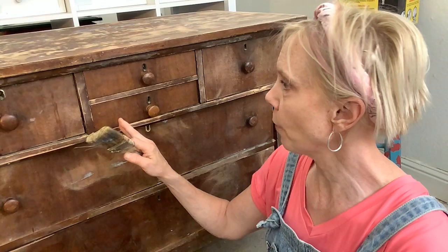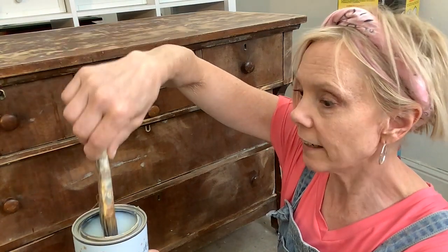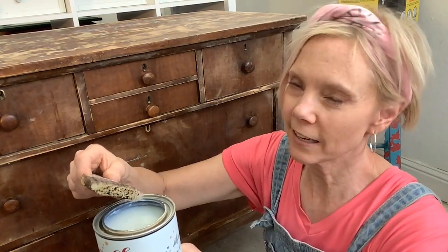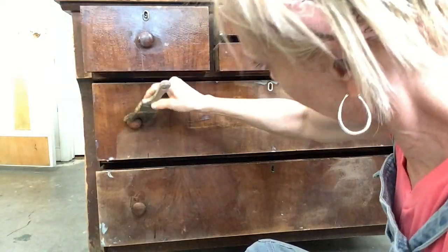To solve this, just use DIY Paint Salvation Solution. It has a little smell to it, so open the windows or make sure you're in a well-ventilated area. Apply one thin coat — it comes in white and clear. I highly recommend keeping this on hand because when you come across a piece that's a bleeder, it's really not fun to have to paint the whole thing again. Brush it on and watch for drips — it will look cloudy at first. Think of this like a color corrector: over 50 like me, sometimes you have to put color corrector on before your makeup. That's what this is.